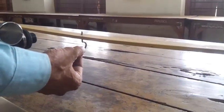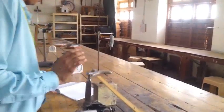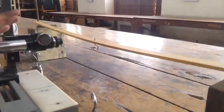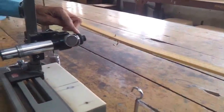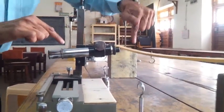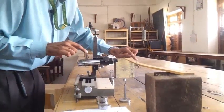At the center there is a pin and hook. First, how do we take the reading? With no load applied, you take the reading from the traveling microscope. You look through the microscope and, using the horizontal cross wire, you align it to the edge of this pin.